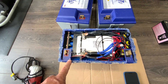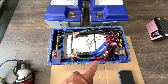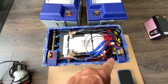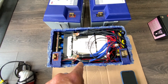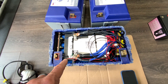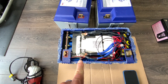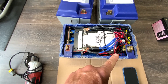The existing BMS only had four balance wires going to battery main — technically the fourth, third, second, and first cell groups. If I checked the voltage from ground to the first balance lead, I got around 3.2 volts. The second doubled to about 6 volts, the third went to 9 volts, and the fourth showed the full 12 volts. All four cell groups were equal — they all measured about 3.2 volts each.